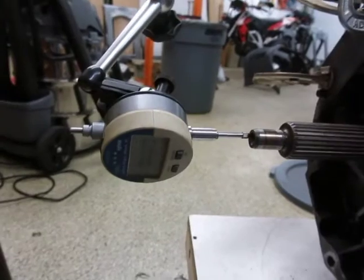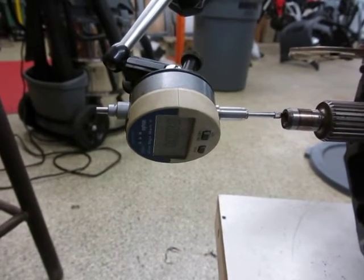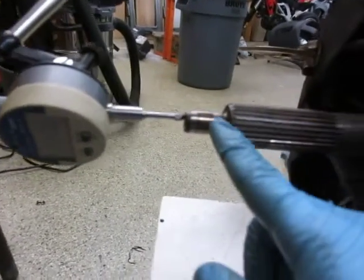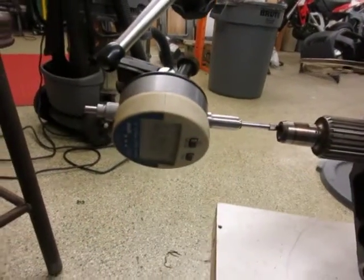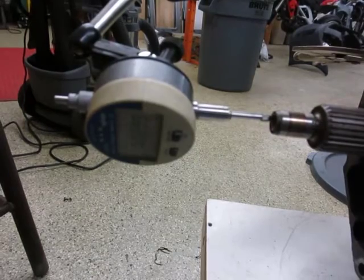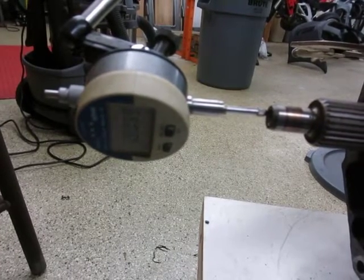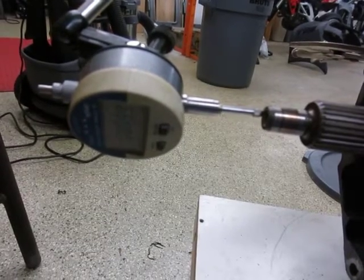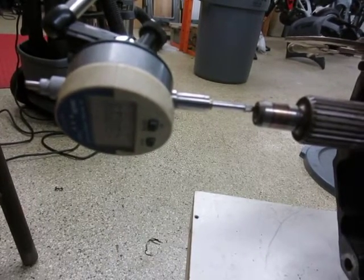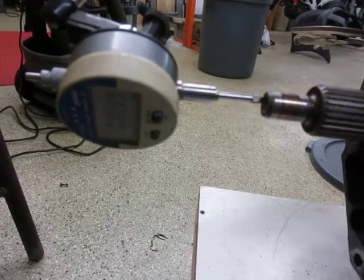After doing this with both hands, I'm managing to show a total travel of about 33 to 34 mils. It's not exactly repeatable because the radial play allows the end effector to go up and down and throws the numbers off. To adjust to factory spec — which is zero to two mils of end play — the experts aim for the tighter end, so I'm going to aim for about one mil of end play. At 34 mils total, a 33 mil shim would give me one mil of end play, and a 32 mil shim would give me two mils. So I'll look for a 32 to 33 mil shim, put it back together, and measure again.